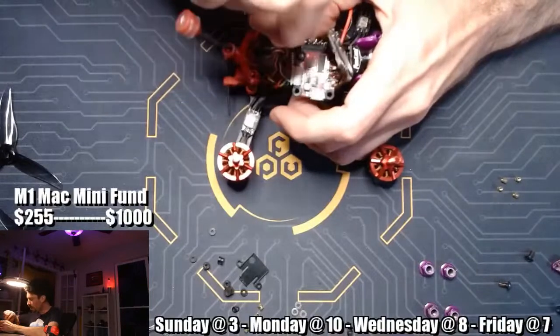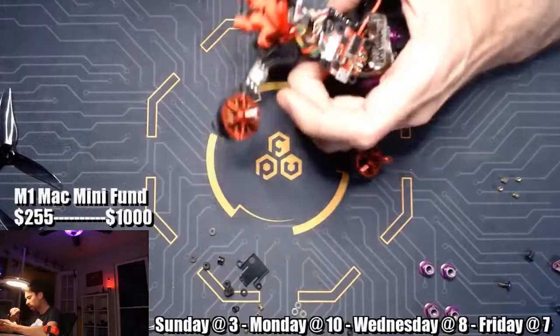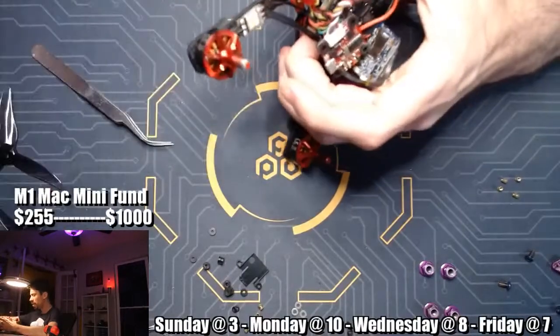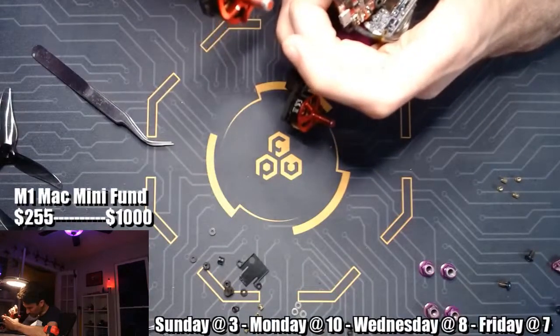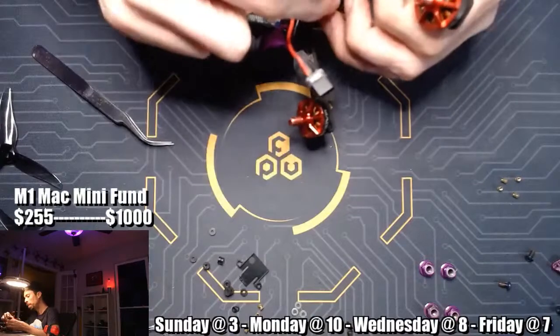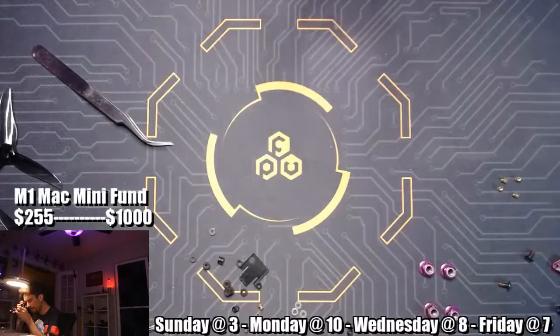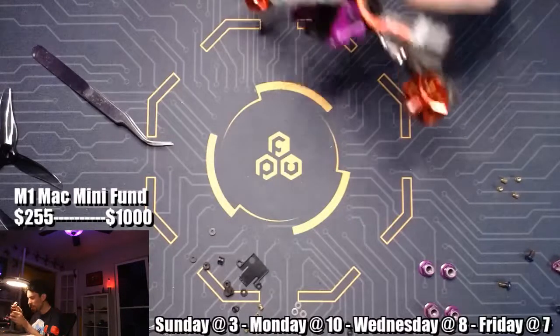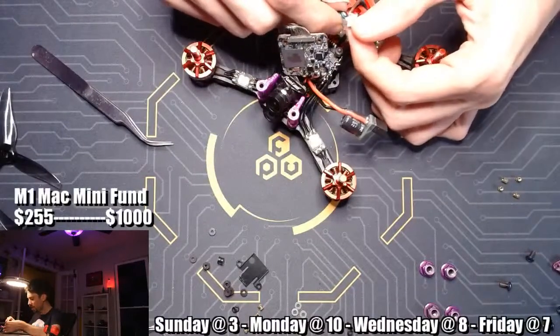The only reason I'm thinking it could be that is that it was kind of cramped when I plugged this in. So let's see here. Just using the 5X loupe to look at the pins. They look fine on that side. It's really hard to see, there's a lot of stuff in the way. Nah, pins are fine. I can see them. Yeah, the pins are totally fine. So the cable is not the issue.